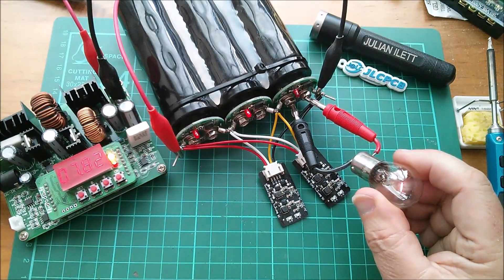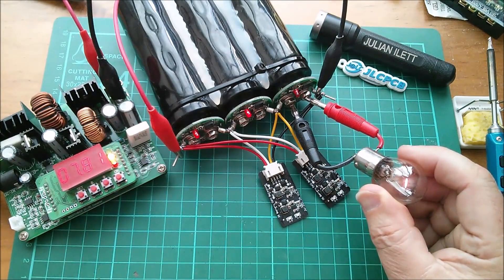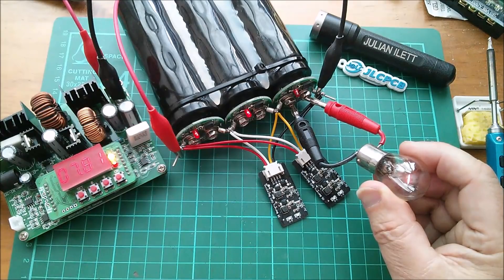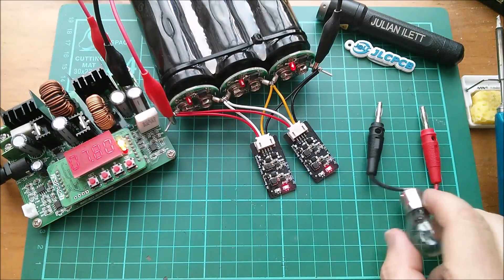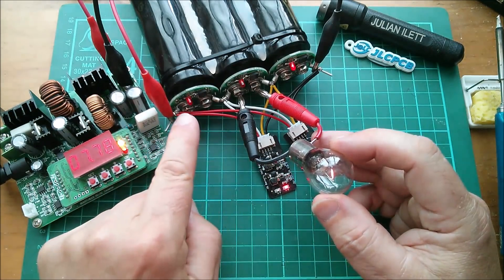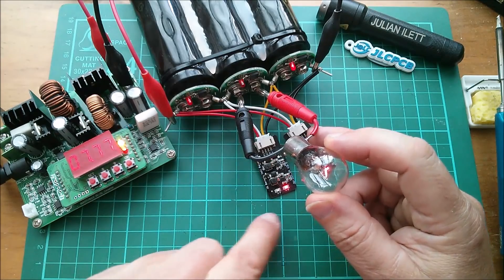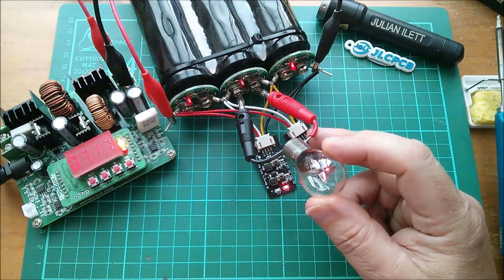Let's take this cell right down — these two are up to 2.5 volts because both their lights are on. These should be doing something by now; I don't really understand why they're not. Now I am getting these two lights on. The camera unfortunately crashed so I missed a few steps. I put the discharge on the center cap — the light's coming back on on the left cap, so it's telling me it's transferring from the right cap to the center one, which has the brightest LED. That makes sense.